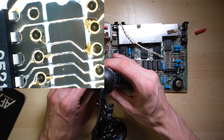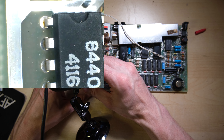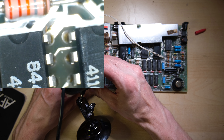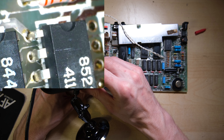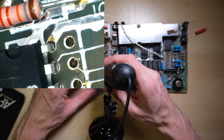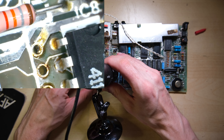So I'm going to get the microscope out and have a close look before deciding to remove any more RAM chips. Let's give it a good clean with surgical spirit and a toothbrush so we can look up close and visually check for shorts. Starting at the back of the board, I'm checking the solder joints where I suspect there's a short on every chip, and double checking the empty joints where I've removed those two sockets. So far everything's looking fine. Let's check the front of the board. You can have a look at the legs of each of the RAM chips as well as the empty joints where I've removed those sockets. These RAM chips haven't been replaced since the thing was built, so they should be fine, but it's worth a quick look.